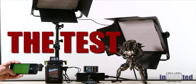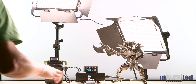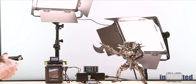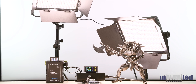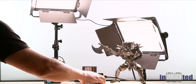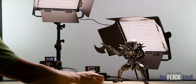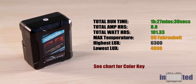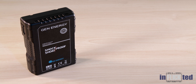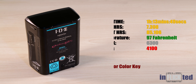For the test, we had a couple of lamps drawing about 6 amps or so. We then took temperature and light readings for each volt loss for each battery, let them rest, recharged them, and repeated the test three times for accuracy. We used a thermal camera to see how hot each battery got and how they handled heat dissipation. The light readings help us see how each battery kept its performance throughout a charge. These are some quick highlights of the test results. However, there is way too much information to be put on a single video, so please take a look at the attachment in the description for a much closer look at what this all means.